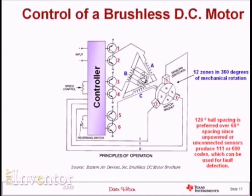That's why I have this hall effect arrangement on the back end of the motor. Here's a little magnetic disc — in this case it's got four pole pieces on it — and I've got three hall effect sensors separated from each other by 120 degrees. These are digital hall effect sensors, which means they don't detect the absolute analog field strength of the magnetic disc; all they detect is when I transition from a north pole to a south pole and vice versa. I have three wires, each carrying binary information — that's two to the third power, eight possible conditions. But with 120-degree spacing on the hall effect sensors, I will never get the condition of 000 or 111. So if my controller ever sees those two codes, that means there's a fault — either the connector has pulled loose, the power supply has gone dead for the hall effect sensors, or something bad has happened — and it can flag that as a fault.